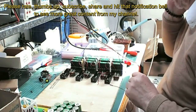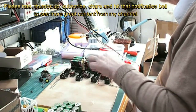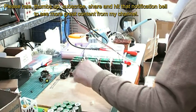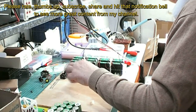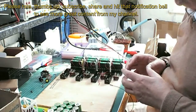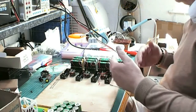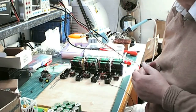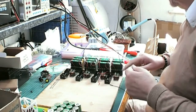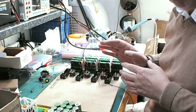Oh, the other thing I've done is I've been putting 100 ohm resistors in series with the input, mainly because what I did was I took a fully charged 18650 and then started at I think it was 1.5k and gradually worked down, whereas the 2N3904 transistor doesn't get warm.